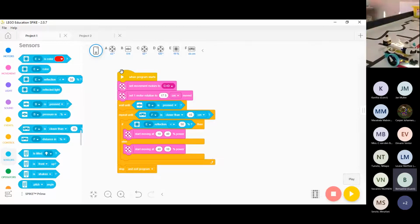Normally touch sensors would be used as bumpers on the side of a robot. So you would attach it to the front and then drive into something, and then you would have the ultrasonic on the other side. Okay, I put the ultrasonic on this side. So I would put a bumper on the back with a touch sensor connected to a beam. And then that would be reversing into the wall.